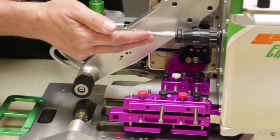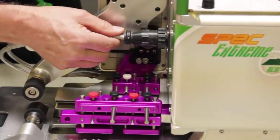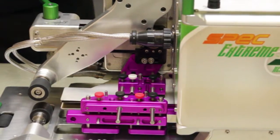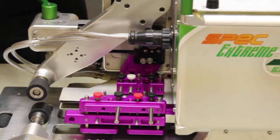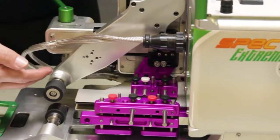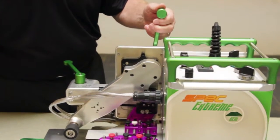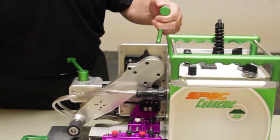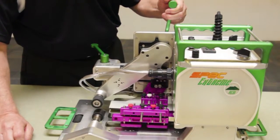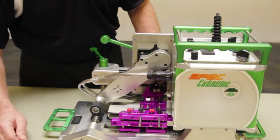In addition, the wiring here plus the connection to the motor box is for the hot wedge. This can easily be spun off and removed when you want to change various weld widths or if you need to replace the hot wedge itself. This is the arm portion here which is controlled by the pinch roller engagement lever up here. When in an open position, it allows you to manipulate and position your material correctly at the welding area, but when closed, it secures the material in position to begin welding.